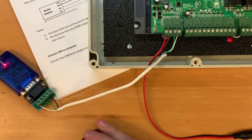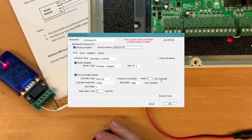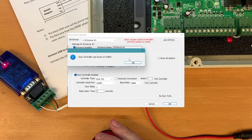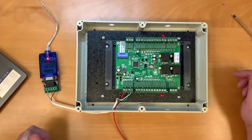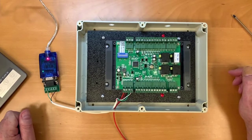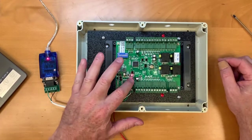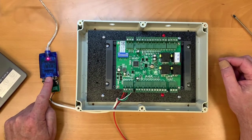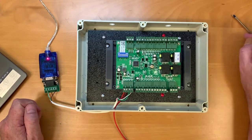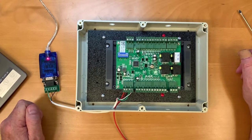Next, install the drivers for the RS-485 adapter on the computer. Then, in Gatekeeper, click 'Find Controller' — if everything is connected, it should tell you what port it's connected to. Once Gatekeeper is connected to the controller, you'll see the communication LEDs blinking green and red, and the green lights flickering on the USB RS-485 adapter as well, indicating that Gatekeeper is now communicating with the controller.